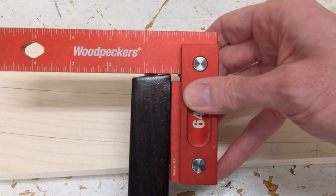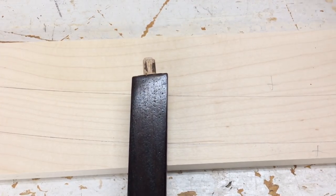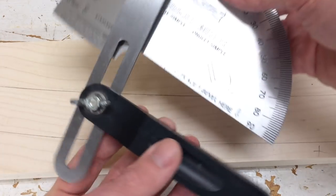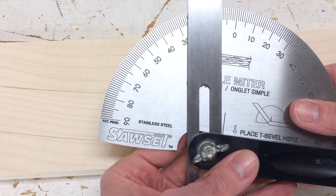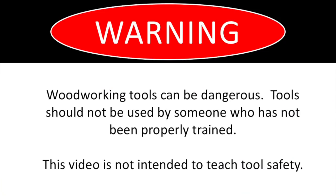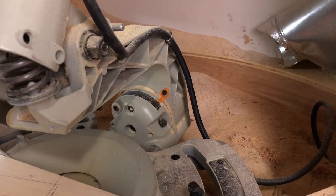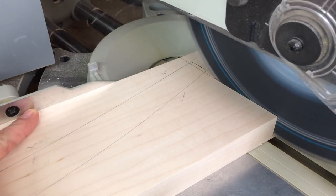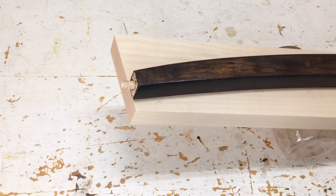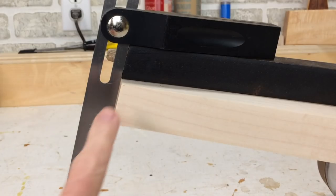On the top of this chair leg, this isn't 90 degrees, so I need to cut that angle. It's easier to cut that angle when I've got a whole board rather than a cut board. So I set my T-bevel to get the right angle, and then from here I can pull up my saw set, line up the T-bevel, and it tells me I've got 5, 6, 7 degrees. I double-checked this by laying down the leg and putting my T-bevel on, and the angle is perfect.